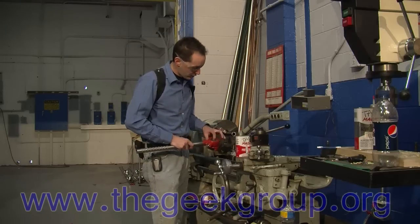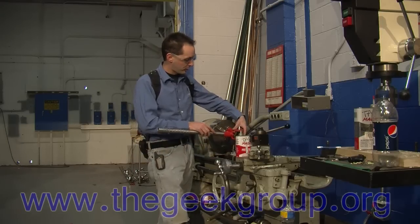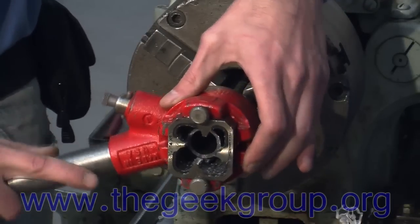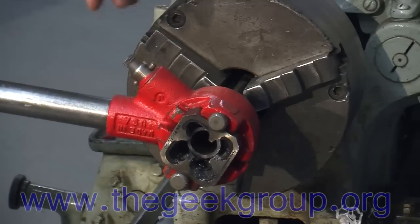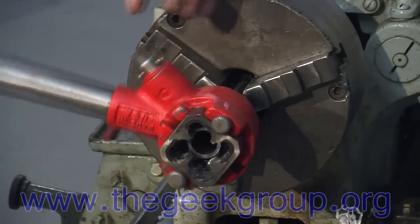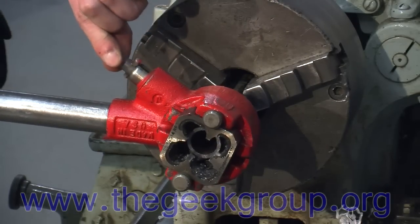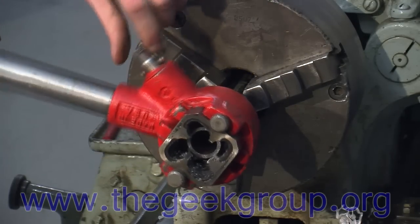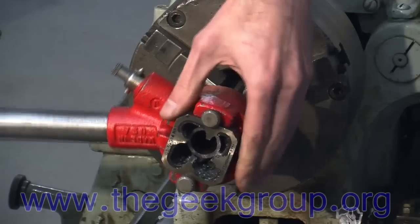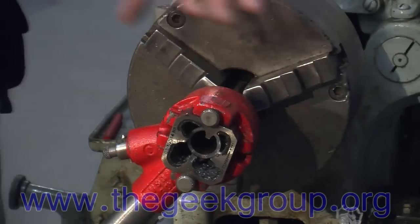The other side is just a tube of the right diameter to guide the pipe in, because when you're cutting threads you want to make sure everything is very straight. So this just slips barely over the pipe and holds everything straight — the rest is just a big lever. There's also a direction selector that works like a ratchet wrench. One side has a little point and the other side is flat — the point is the direction you want to travel. That's how it's set up. So that's the basics of the tap and die system.